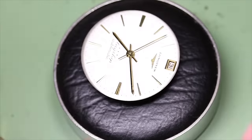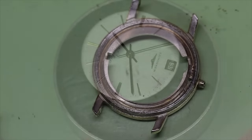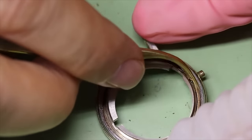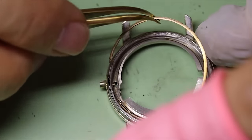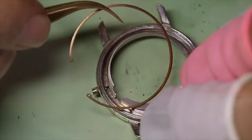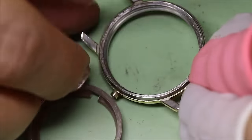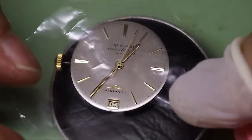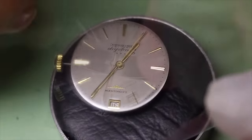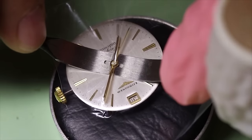Finally we have the movement completely out. I'm also going to release the spacer from the case itself — and calling it a spacer might not actually do justice because it also holds the whole movement in place including the rotor. Now we can finally also take the hands off, and of course we need to be very careful with the dial, and finally take the dial itself off.